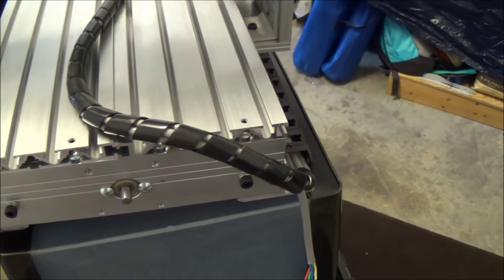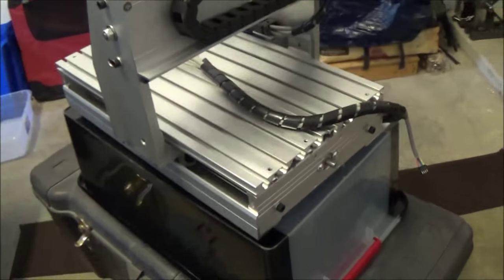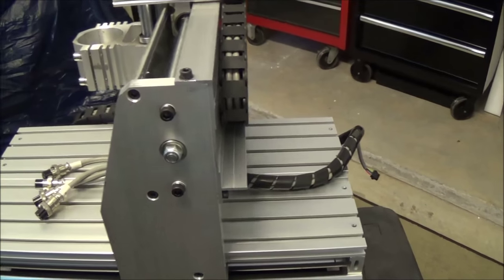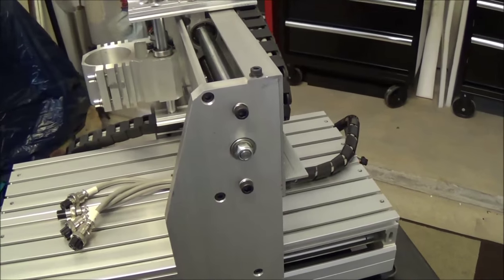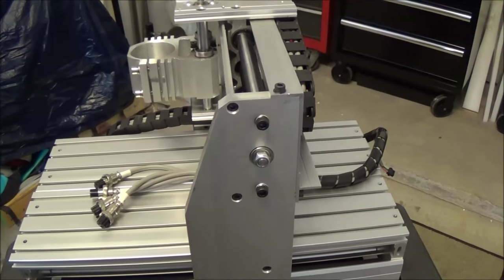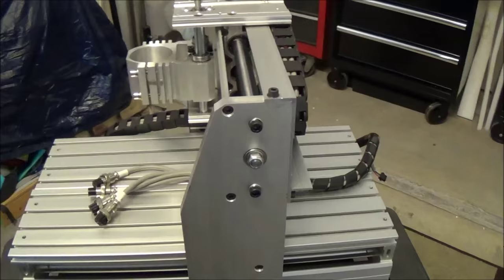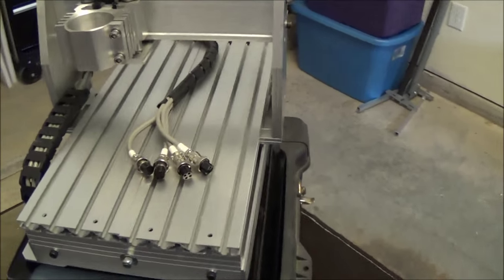Like I said, for the money, it's not a bad machine, but don't think that you're going to be running a business off it or doing any kind of high volume production, because they're just not made for that. There's resonant frequencies all over the spindle, and I'll do a quick snapshot of the spindle itself, but it's just the ER adapter pushed onto, I don't know, a 5mm shaft or something with a press fit. And amazingly, you could spool it up to a good 20,000 RPM, but it's just a terrible, terrible idea.